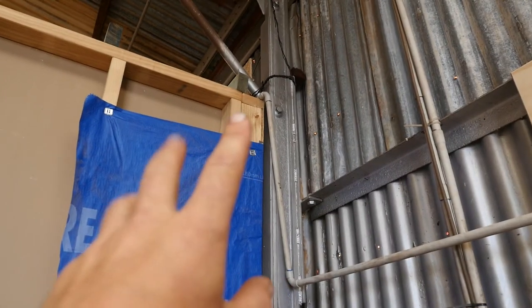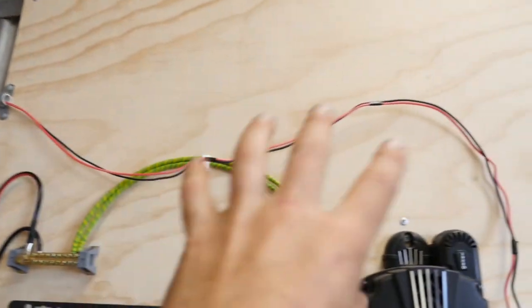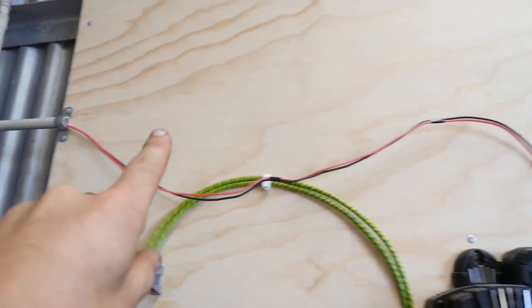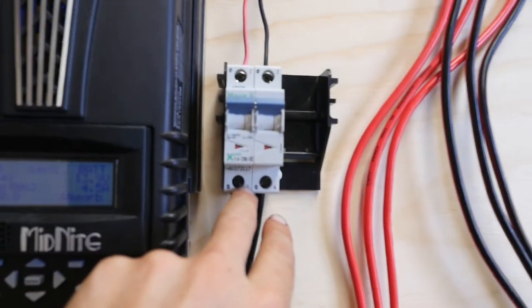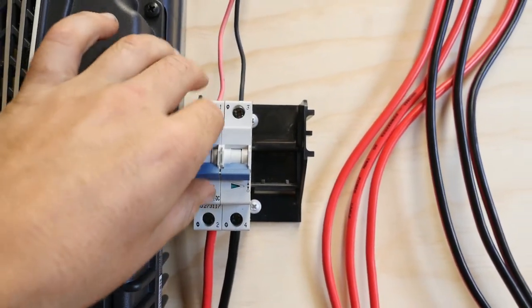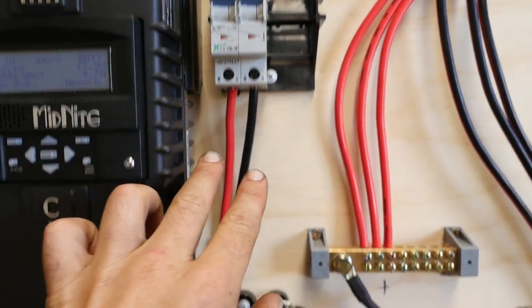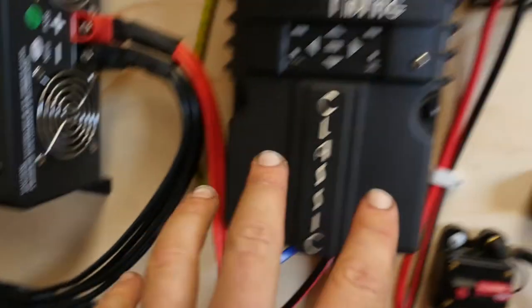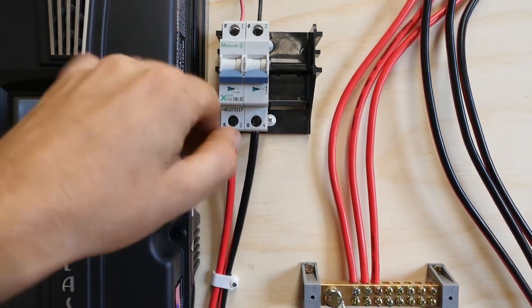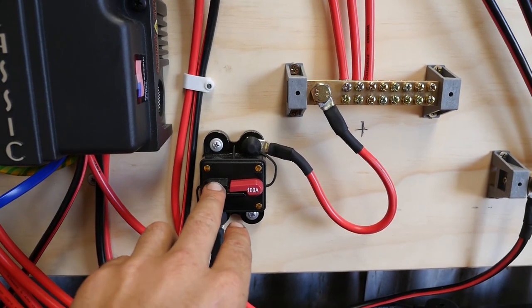So that's where it comes out of the house through the conduit — a black wire and a red wire. I need to tidy that up. But it comes out and then I've got it onto this circuit breaker, which I can isolate to turn it off — so no lights are in that room — and then that turns it on. These are connected to the positive and negative of the battery terminals, just like your charge controller and inverter would be. It's a secondary switch which I can control, just like the solar switch where I can turn the solar off and on.